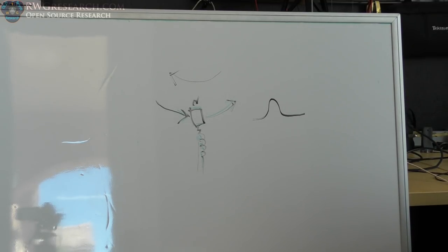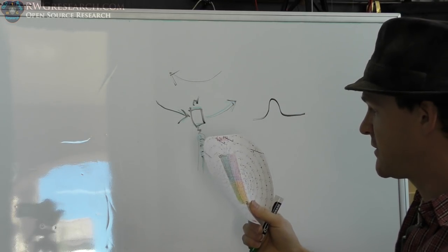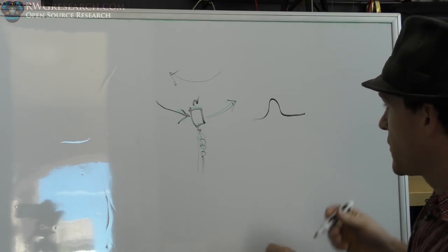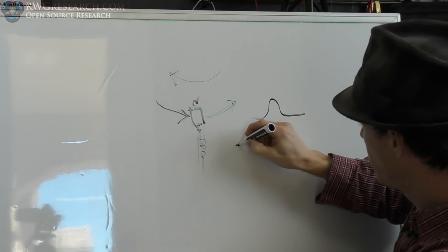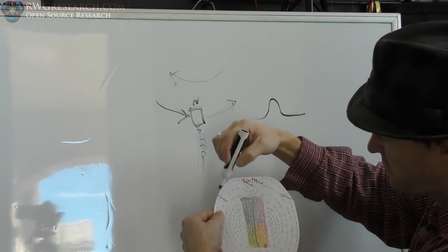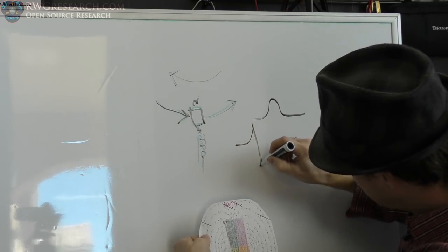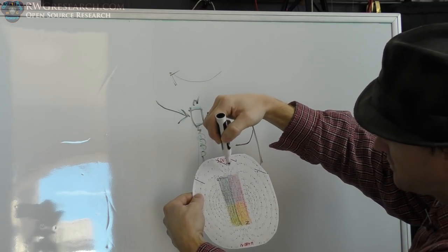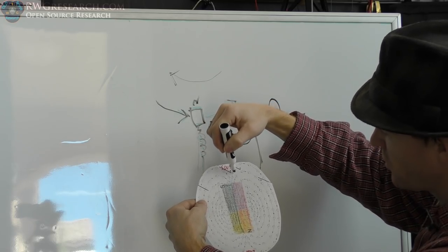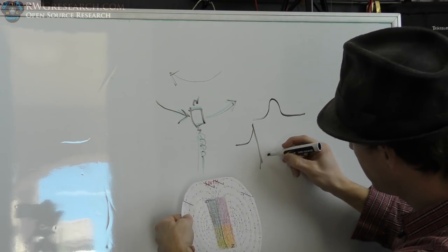Now, if you look right here at this diagram, Newman says you're going to see a completely different interaction. Newman actually states you're going to see the first cut of the flux right here, then the second cut of the flux, which is actually two times the cutting, because you're cutting this one and that one at the same time or right next to each other. So it's actually more flux density.